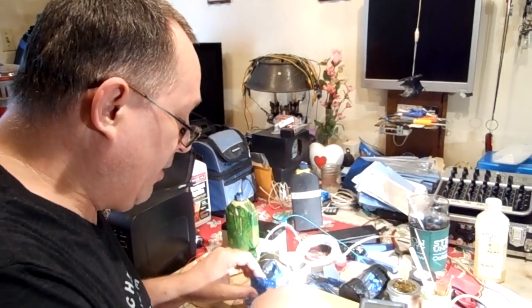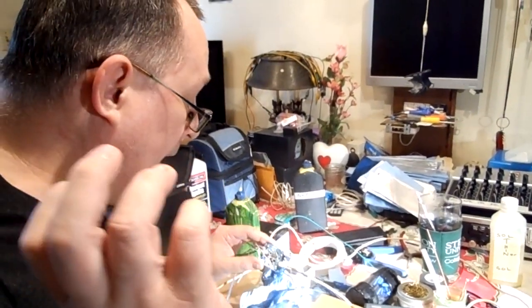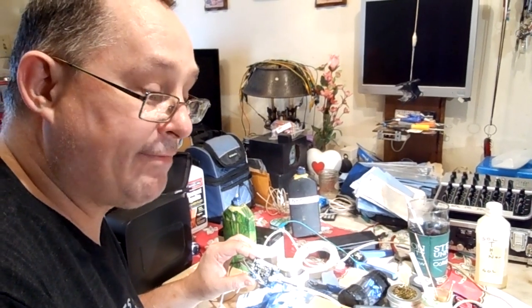This came from an eBay auction. It's a preamp, a 5532 is the name of the chip. And in the specs online for the auction, it said that this runs at a 600 milliamp draw. And there's no way that this thing's gobbling up more than half of 1 amp. This little tiny chip preamp. So we're going to actually test that and see what it is sucking.